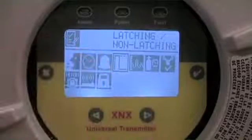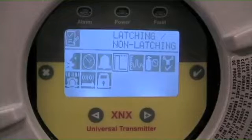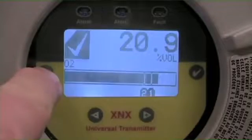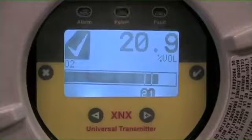From this point, we've made the range adjustments. We've set our alarm values, our alarm personalities, and latching functions for the alarms. I can now exit out by highlighting the X button, and I'm back into my display value with my range and alarm values set as necessary.